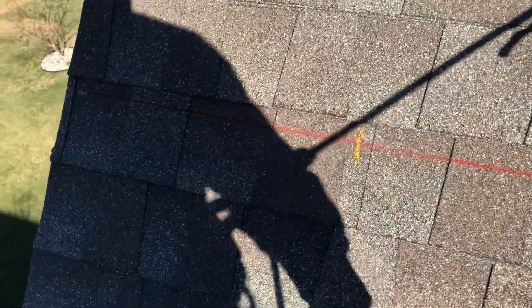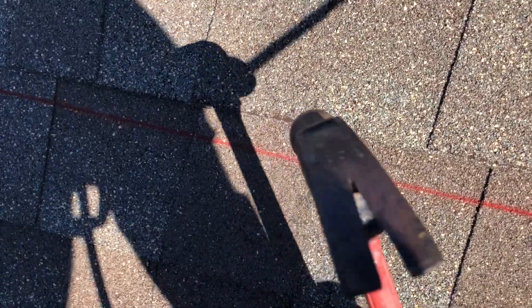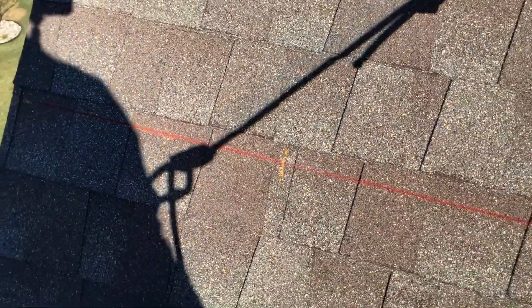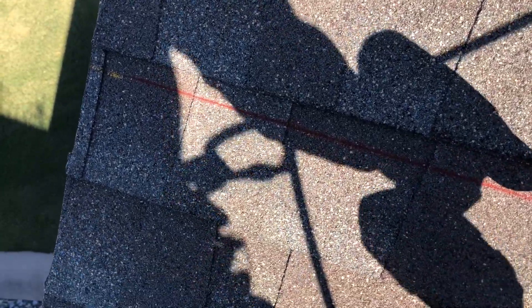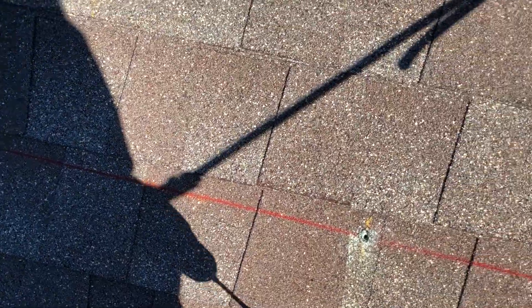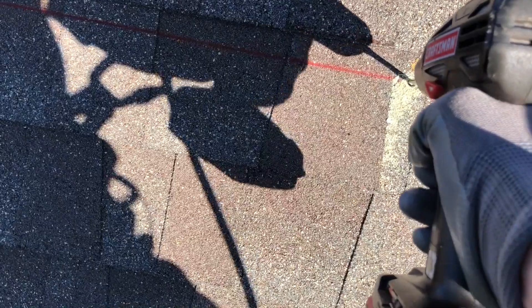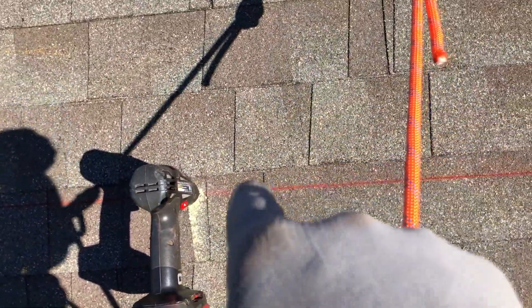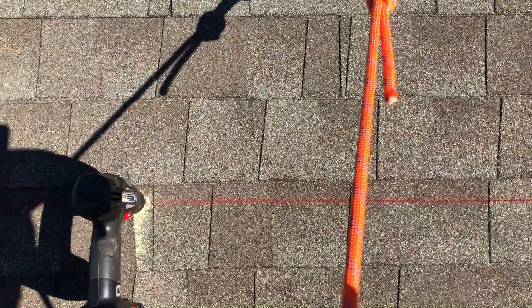I went ahead and snapped my line — that's going to be my first rail. It was more than five inches when I came trying to find my stud. You can hear that thud get louder — that's where my first bracket is going to be. You can tell especially when you hit a stud; it grabs. You can hook your tape on and mark off every four feet, or whatever the plan set has provided.